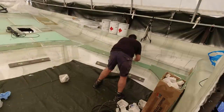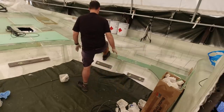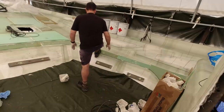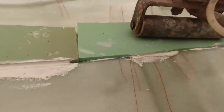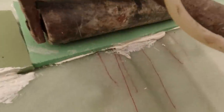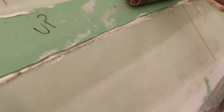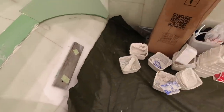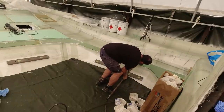Last week I started talking about how I was going to integrate the core into the actual window sills. It transpired that I was able to put these sections in first, then sand them flat, and then lay the other foam core - the 25-millimeter cross-cut H80 foam - across the top of it and then hand-shape it back. It's like doing about a hundred surfboards in this period and it did create quite a lot of excess work. The coring of this deck is so important and there was a lot of laborious work that went into getting the shape right.